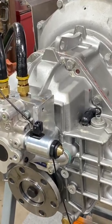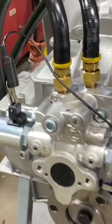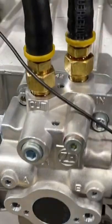Testing out this ZF85 off a late-model Volvo Penta engine we just rebuilt. It's got EVC-EC, which is electronic vessel control by Volvo. So it's got these two electric solenoids here, and I just did a little jumper pack hookup here to test it.